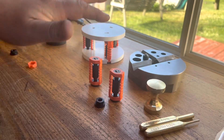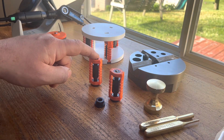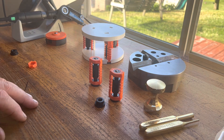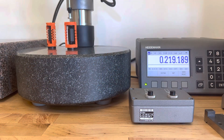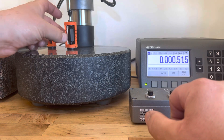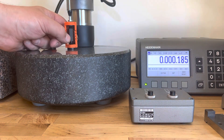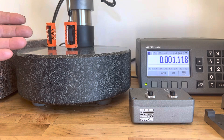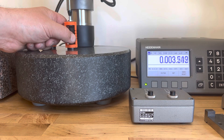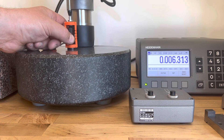You can go a lot of different directions depending on which threads you pick. I think this is a good direction, and I wanted to throw it out there and see what people could do with it iteratively. I've set the jack up on the Heidenhain gauge — I think this is a good place to visualize the movement. We'll get one of the flats squared up and zero the gauge. We can see one flat increment is a thousandth and a tenth and some change. If we go through and do an entire revolution, we should see about 6 thousandths and 3 tenths. There we go.